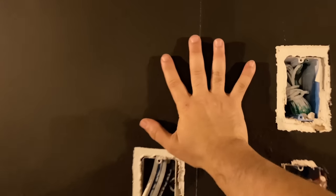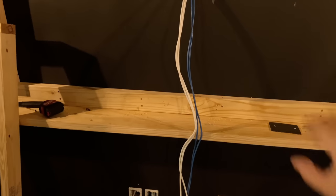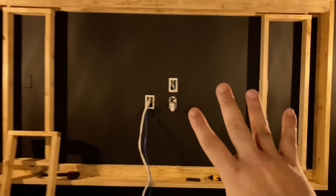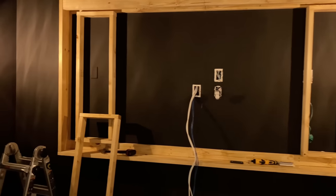This is built out to help optimize that to even happen, because you wouldn't necessarily need all this. Right here is an exterior wall — it's like a quadruple stud — and there's no way that we could have notched that to put the speaker in there left and right. So what we're doing is building this box, bringing the screen out so you have a little bit of room and also a little bit of wiggle room for the actual speaker so that it doesn't interfere with the screen whenever the voice or explosion happens up front.